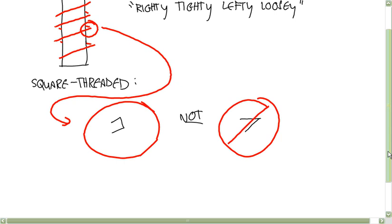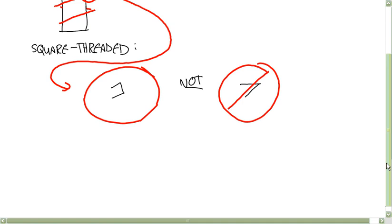And these are the kind of screws that you use in jacks and holding up supports. In order to use this kind of screw, it's like when metal meets in two places, right? You have a machined track for the thread to go in, so you have two machined parts. So not wood screws, not things that are making their own path. Threaded nut. Yeah, that's right, exactly.